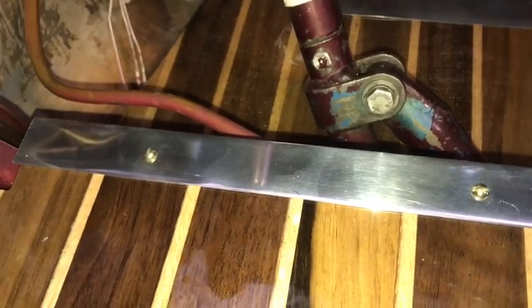The other question I kept asking myself was what to do about this edge, because it has a pretty good drop-off here. I was just gonna router it, but I ended up buying this angle aluminum — anodized on one side and polished on the other — and used brass wood screws to fix it in. I think that's probably the most durable edge I could put there, because people's heels are gonna be kicking on it.